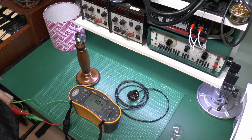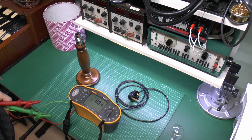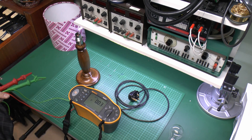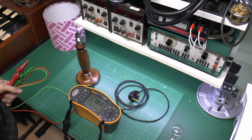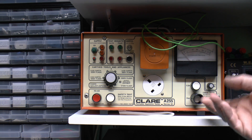In theory these things should be less than 0.1 ohms, and in most cases they easily are. Of course with a very long lead it might be higher, but there's only a couple of metres of flex here so you'd expect it pretty much near zero. So you can use these meters if you've got one. The main thing is it tests at 500 volts and puts around 200 milliamps through the wires rather than a normal multimeter which might put a very small current indeed. However, 200 milliamps is a bit inadequate for things you've just assembled or reassembled, because if there was a thin strand of wire barely connecting to something, 200 milliamps will pass through there when it's really not safe - a large current could just melt that piece of wire away before the fuse operated.